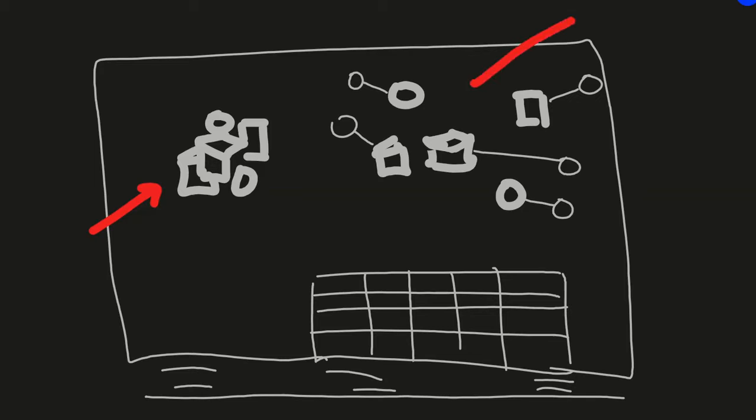Make sure to distinguish your parts with different colors. Then we will have an exploded view here, and it will include annotations. This will be like 1, 2, 3, 4, 5, 6, or whatever. And then also I expect to see a parts list down at the bottom. And you should also have a title block down here that has things like your team name and the date and what we're looking at.